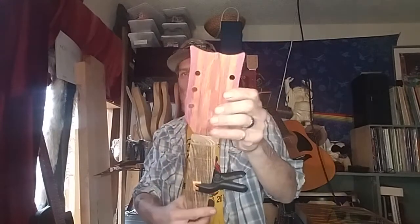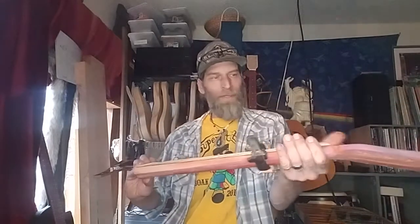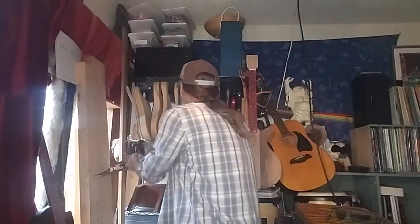I decided to carve the neck like a bird. My intention was that when you're looking at it from this direction, you can see the top kind of comes out like a bird beak and the wings curve up — so it was all about seeing it at a certain angle. It's not very standard, but I don't really care if it's standard because I like to do things my own way. On top of that I'm putting a zebrawood fretboard with purple inlays which, when finished, will be dark purple, glow in the dark, and are blacklight reactive — they match the purple in here perfectly. So this will be the guitar neck that goes on probably this body I have: a Stratocaster body I'm working on right now.